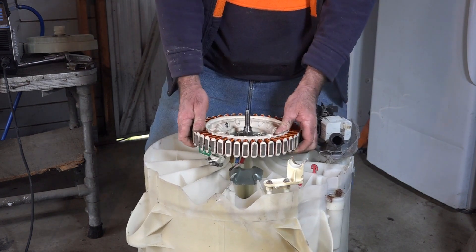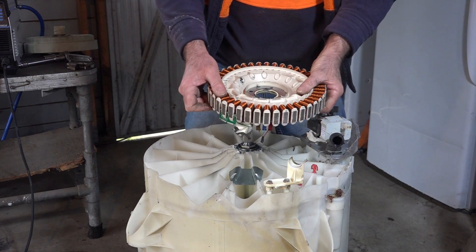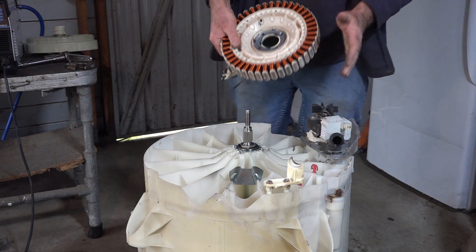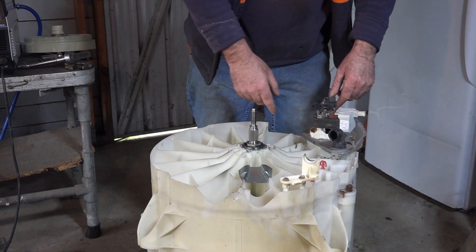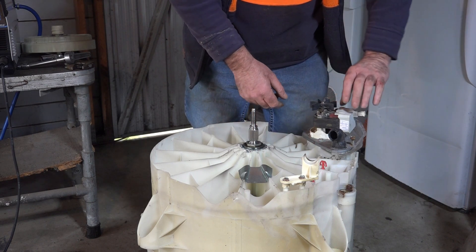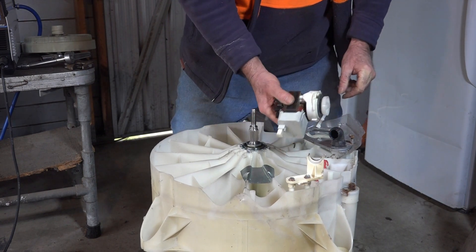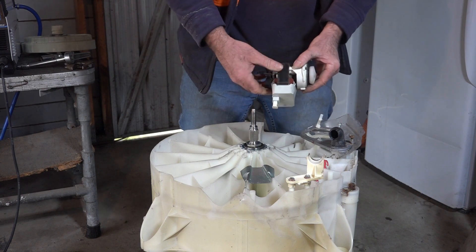So there we go, get them off there like so, get rid of the bolts. This is quite weighty - a lot of copper in there, so that's worth some money. I'd hate to know what it's worth to buy new if you had to repair your bloody washing machine, but anyway - stick them to one side, put them in our good copper bin. See the pump here, it's got four screws in it but it's a pain in the ass to take them out - all they're doing is holding this tin plate. I want the copper out of here, so just grab your pump and you'll find it's on a bit of a swivel thing. If you just give it a good yank you'll find you can just take it out of the bracket. Take it out like so, leave the bracket on there because it's only worth two cents, but you've got some more copper in here - put that in our copper bin.